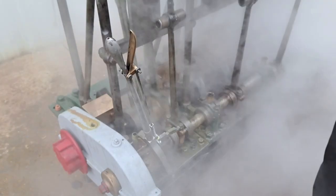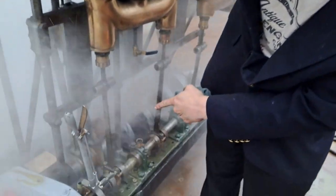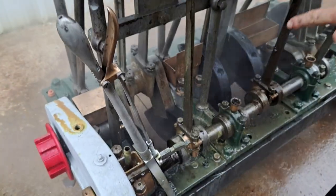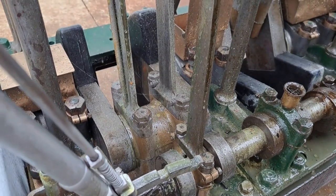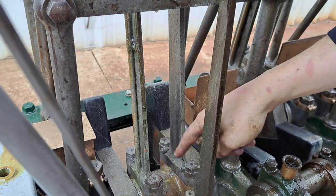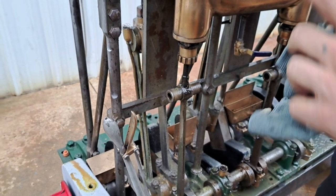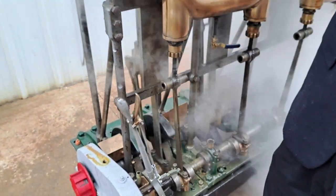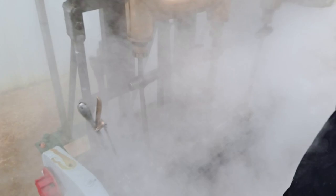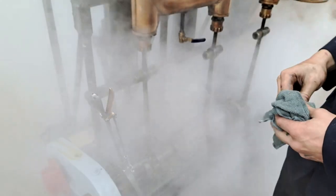There's another thing I love about Perishoff's engine — he was such a brilliant designer and he got the reciprocating masses right down. The main rods are hollow, box type — two very thin ones connecting to the big bearing and the small end bearing. They're very light. The pistons are very thin and conical. So this engine, as you can see, runs like it has a flywheel even with no flywheel on it. And it's a triple — usually most triple expansion engines or compounds are very rough running even if you get the timing right.